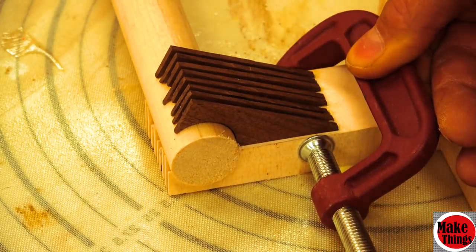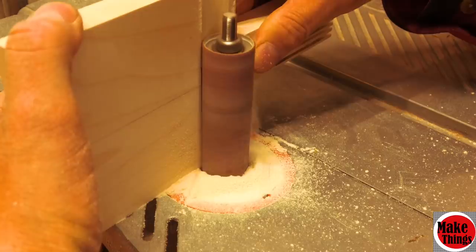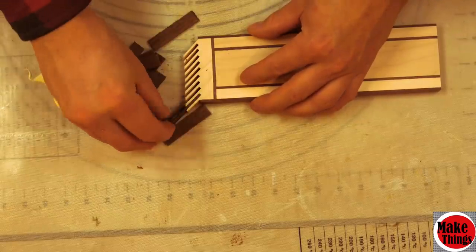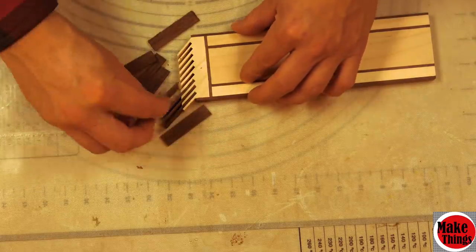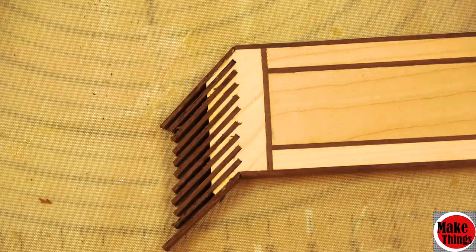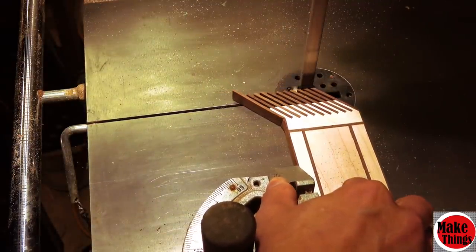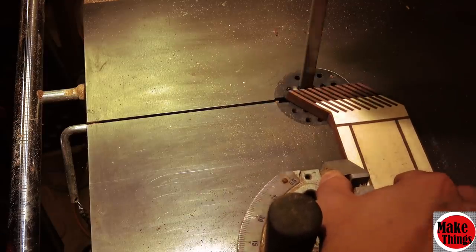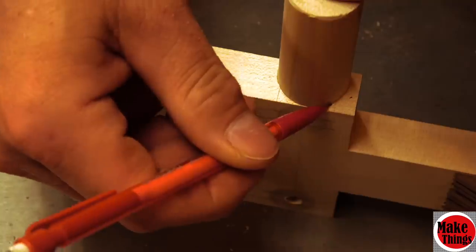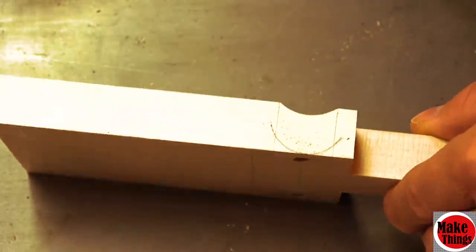I clamped things up and gave it a few hours to dry. Instead of the triangles from the prototype, I decided I wanted to add a cove — it was one less glue-up and made it feel less cluttered. With the horizontal featherboard, I made it so that the teeth were at an angle and glued in walnut strips that I had previously soaked in ammonia. In my last video I used ammonia to soften the wood and decided to incorporate that into this project. When the glue dried I cut it flat with the bandsaw — if you do this, be careful as the wood will want to split. I decided the best fulcrum for this newer version would be one that contoured with the dowel pivot, allowing tightening of the knobs a better grip and not putting pressure on the knob stud as the previous one had done.